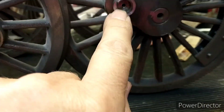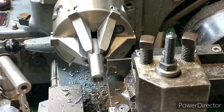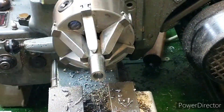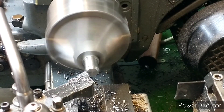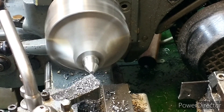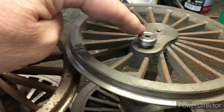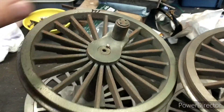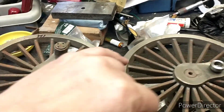I've bored these out to just under 12mm so I've got a reasonably good fit. I've made adapters for the 11mm and 12mm pins with an outer diameter that matches the axle, so effectively they're all the same. I've also got a center that is also the same diameter as this axle.